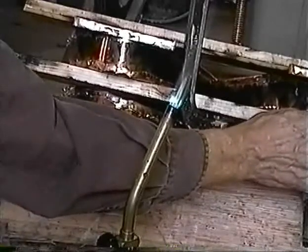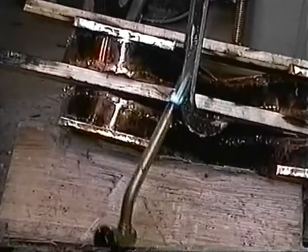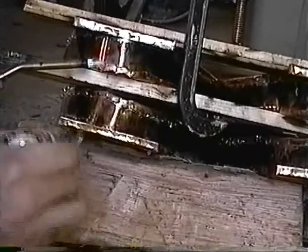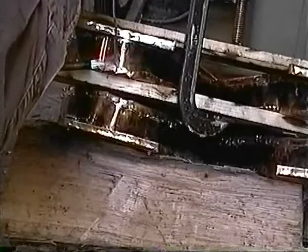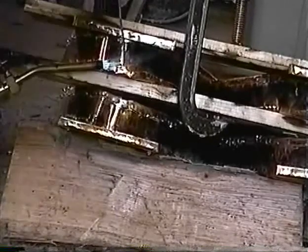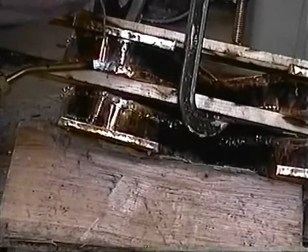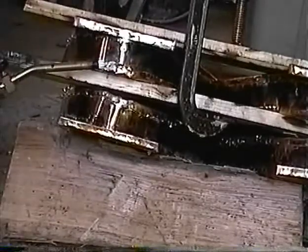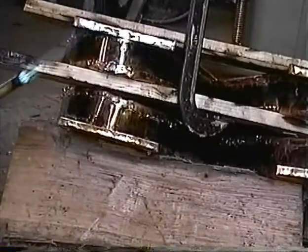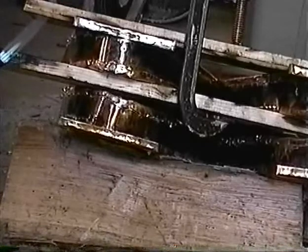Start by soldering just a spot on the backs of both parabolas. You apply the heat in about 15 seconds and it will get hot enough for the solder to begin to draw into the joint. As soon as it draws in, you should withdraw the flame so that it doesn't continue running down on the inside.